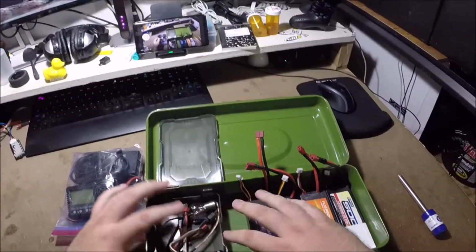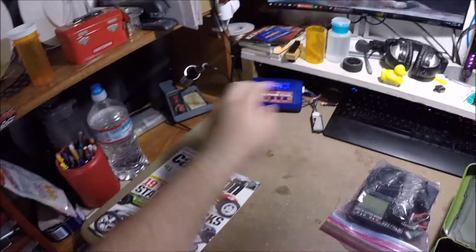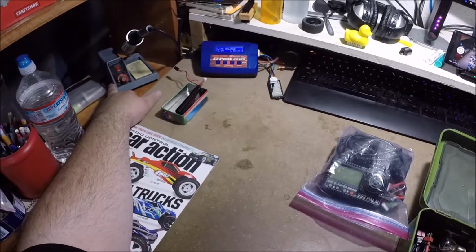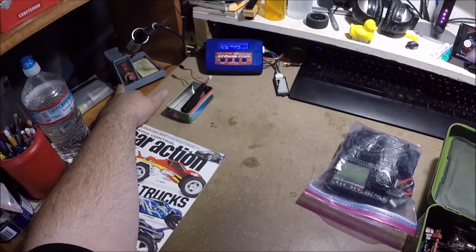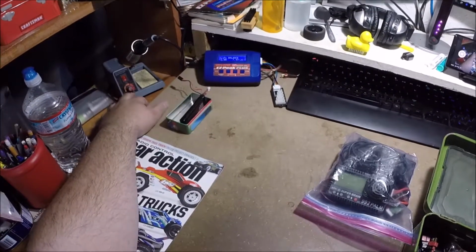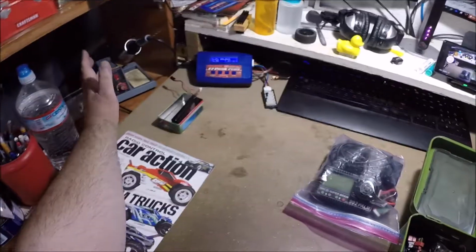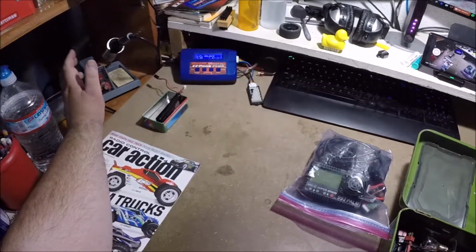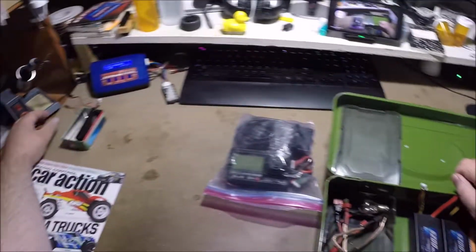And I've made pretty much all these connectors, and I'm just using an inexpensive Amazon soldering iron. I want to say it was 20 bucks, maybe 25. But it gets up pretty hot. This is saying 450 Celsius. I don't know what that is in Fahrenheit, but it's hot enough. I can turn it on for a few minutes before I solder, and then it's hot enough and I haven't had any issues. I can undo factory soldering or whatever, so it works.